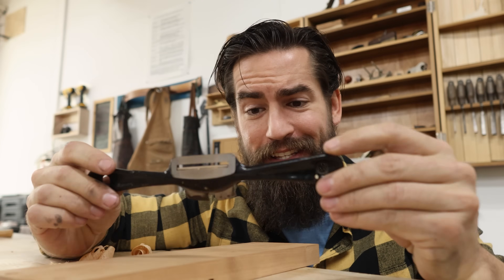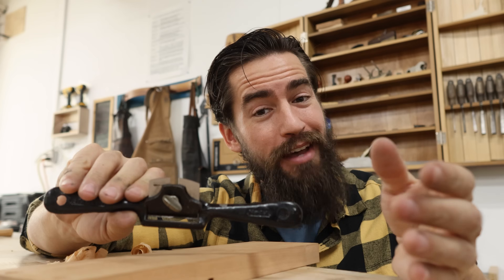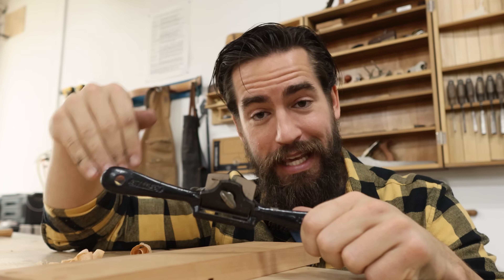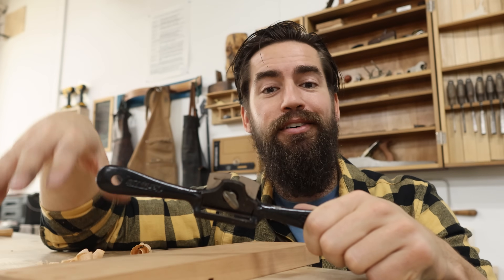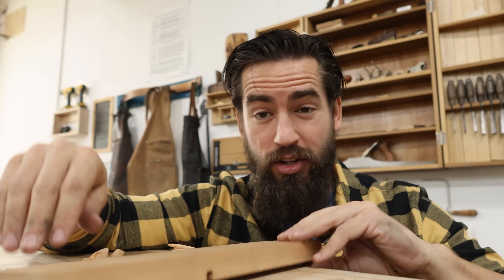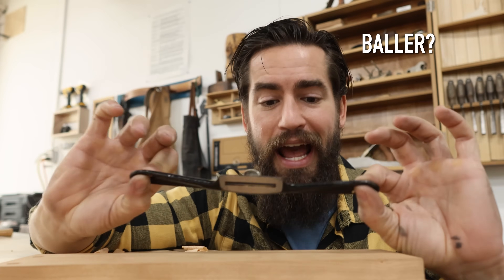That thing is perfect — it's exactly what my old one was doing. It looks good, it feels good, it's cutting beautifully. And the restoration took about an hour and a half — from the start of filming to right now, about 85 minutes or so. It was just 600 grit sandpaper on that tile and then straight to a strop with a compound somewhere around 15,000 grit. And you can see the shavings I'm getting — the surface quality is absolutely phenomenal. Whatever your sharpening system is, it doesn't matter; it's the results you're getting from it.